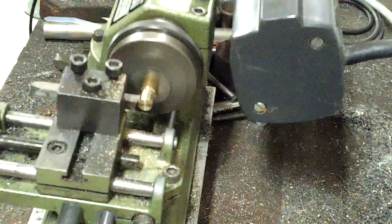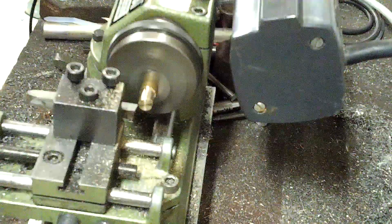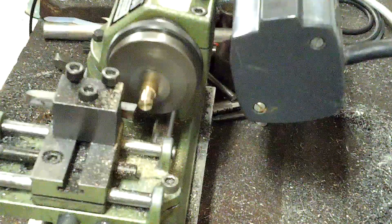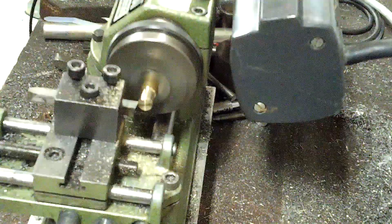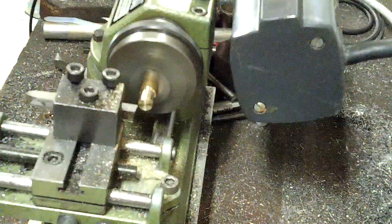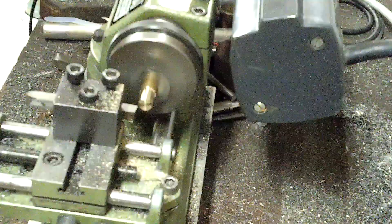The only thing I can say is I think this machine is developing just a little bit of backlash, so I don't know that I'm necessarily making exactly the cut I think I'm making. Let's go ahead and ease this out. Sorry for the delay — just trying to find the happy place here. Let's go to four thousandths.